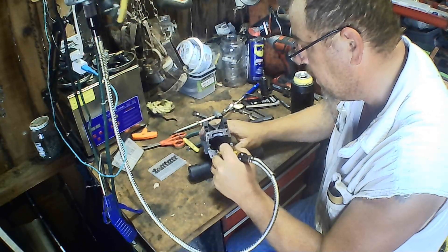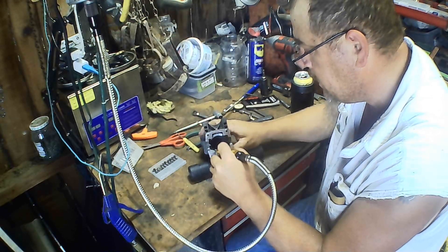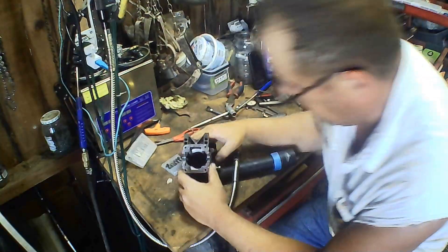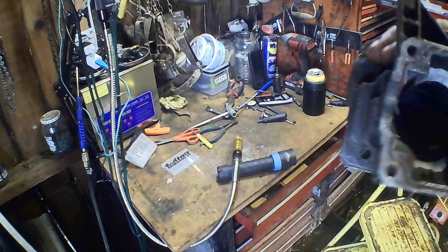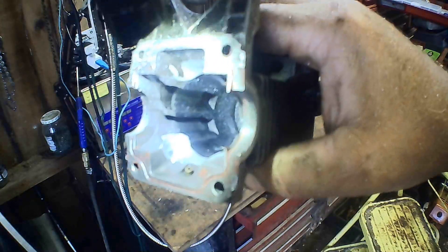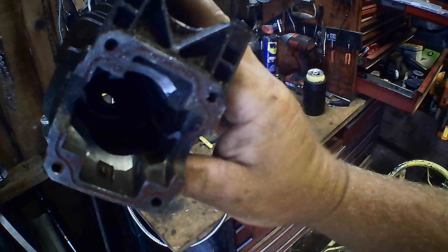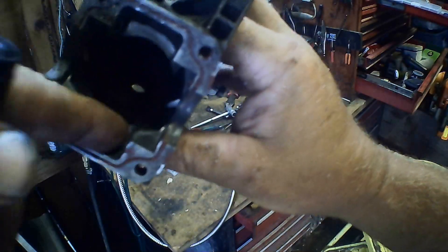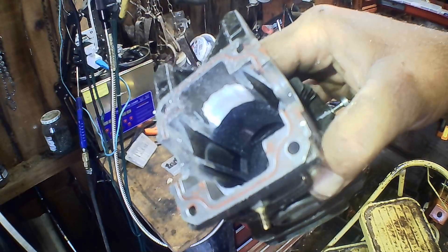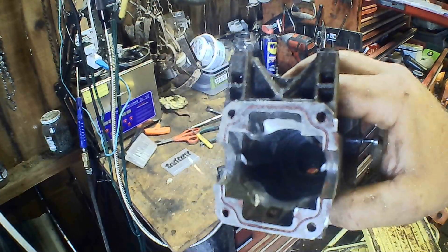And there's quite a bit of hog in here. I'll show you what I've got here when I get done tonight. Now I got one side of this started here. Let me get back here where you guys can see. You can see I've taken that corner off. There was the factory corner right here — you can see how that's sharp and squared off there. Can't get around that good. This side here, you can see it's no longer sharp and it directs that air right up into them transfers. Didn't take that much metal. I'll do the other side.